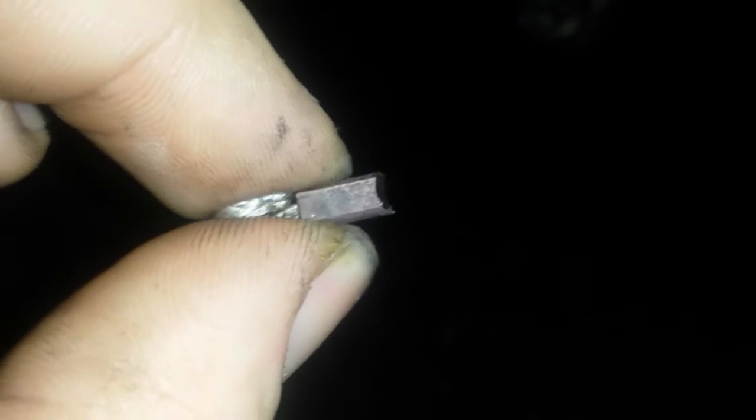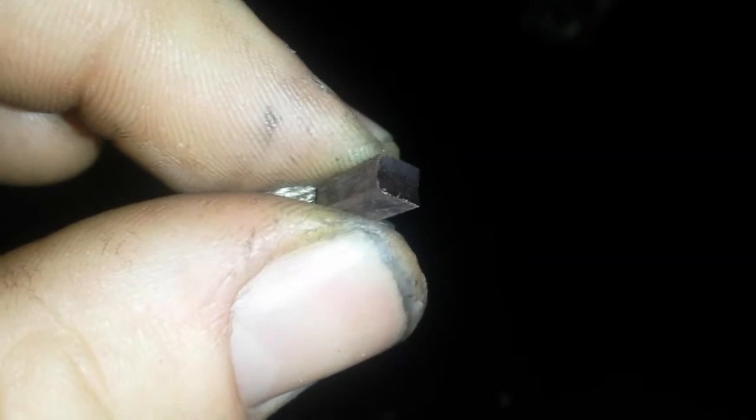Basically, when you get the brushes they're flat, but as you can see on this one - can you see the way it's gone like that, like a groove in it? That's because it's fitted around the comm. The more contact patch you've got there onto the comm, the more torque you have.